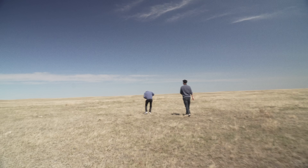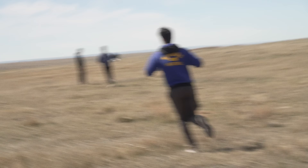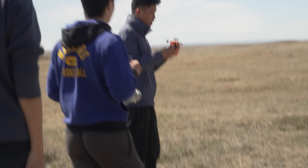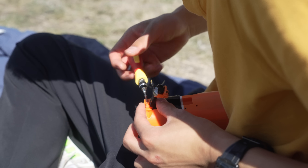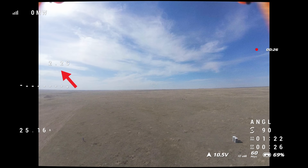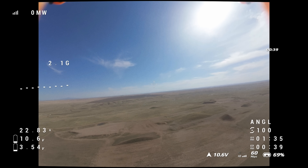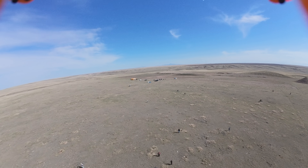Luckily, we knew the general location of the CANSAT thanks to the onboard footage, and it only took 3 to 4 minutes before it was located — and it was still intact! The CANSAT was completely intact with only slight bending in one of the arms, so after getting the arms replaced, the satellite was as good as new. We even managed to recover our data thanks to a single g-force indicator — just make a program to grab the value from every frame, graph it over time, do some integration, and now you have altitude. We spent the rest of the day flying it around for fun and doing freefall tests. We were also offered a second launch on a bigger and more powerful rocket in Seattle during the summer, so let me know in the comments if you're interested.